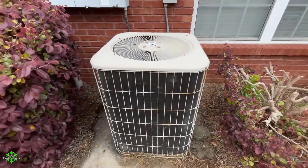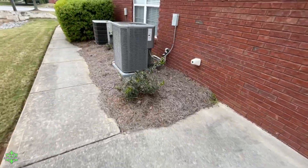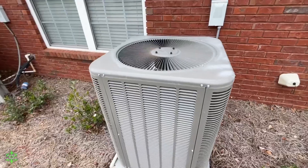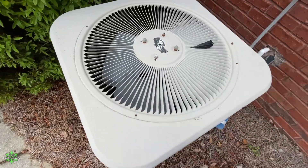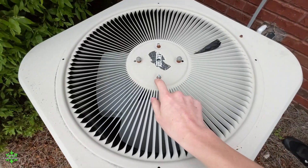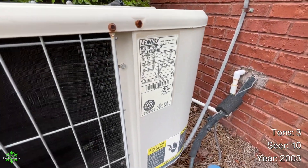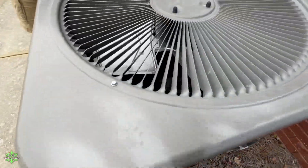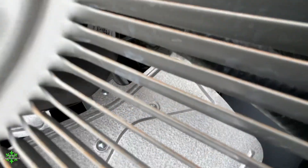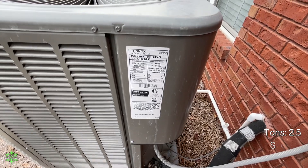I kept thinking there's another unit over there, but there's not. These ones — probably four blade — I've gotten this one defrosting before, new motor. It's a 2003 three-ton, 10 SEER. I've never gotten a video on this one — this is a newer one. What kind of compressor is this one? LG. It is a one-and-a-half ton, 14 SEER from 2018.